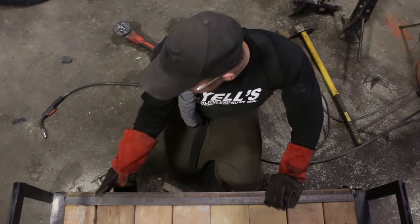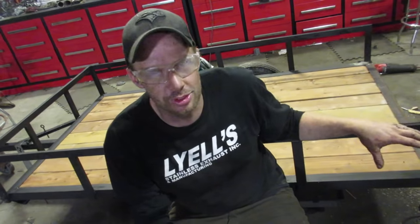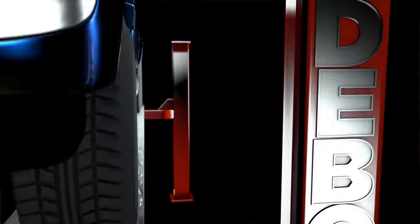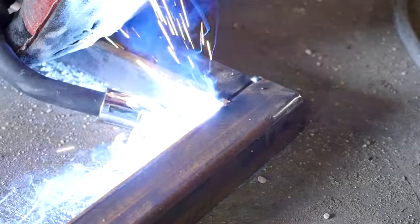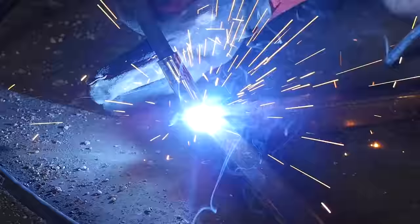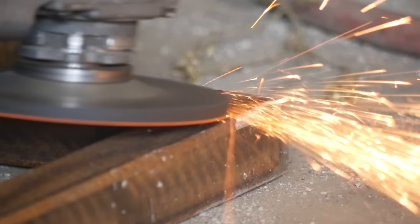That's beautiful. At this point, after working on an old rotten camper trailer with used steel — if you're not filthy yet, you're not trying hard enough. It's important as you're MIG welding to make sure that your cup stays clean. Tack everything together and then move your wand back and forth between the two metals to get good penetration. MIG doesn't penetrate as much as a stick welder does.